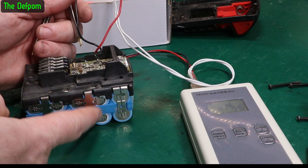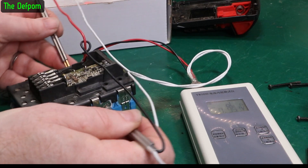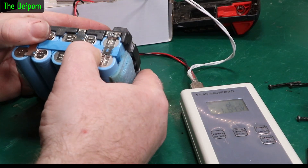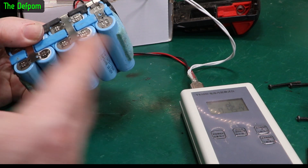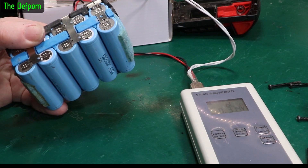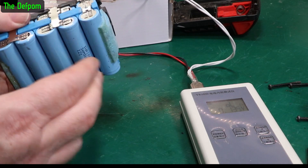There we go - that's the bad pair. Next ones: 4.06 and 9.63 milliohms. So this end pair here - one or potentially both of those are bad. If you get one bad cell it drags down the one next to it because it will discharge into it. Sometimes it's just a weak battery that goes out of sync and lags behind, so it gradually ends up bad. Because they're in a pair they're both going to get dragged down.